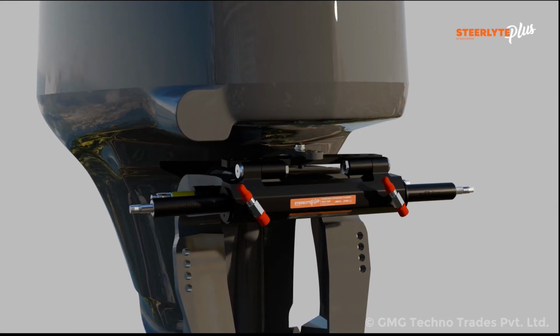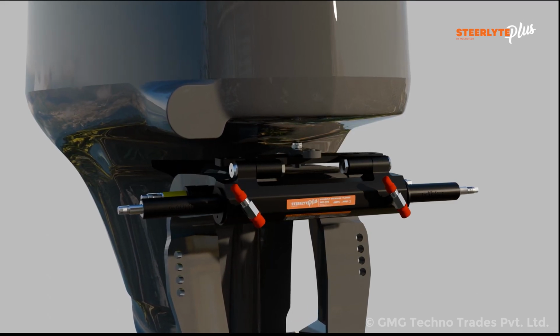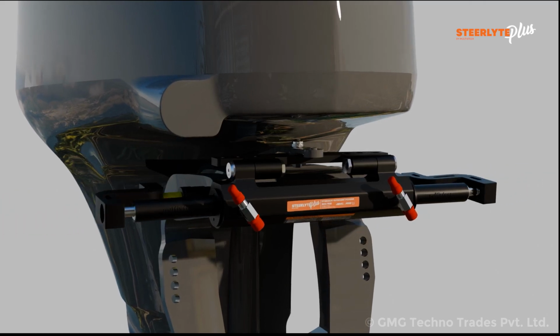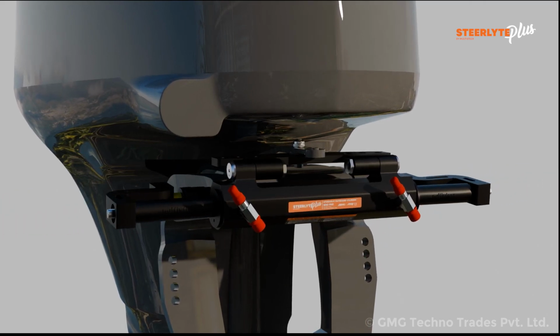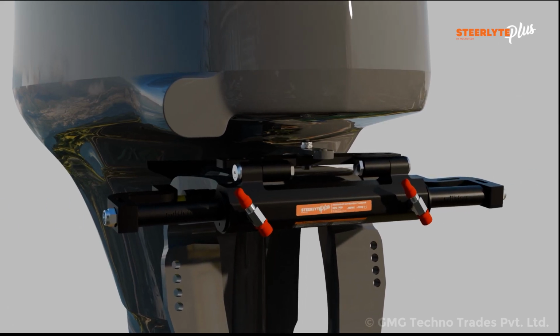In this phase ensure that the cylinder body is centered on the piston rod and that the engine is perpendicular to the transom. Insert the right and left support brackets by connecting both the piston and support rods. Insert the washers and nylock nut on the 2 ends of the support rod and piston rod respectively. Grease the nylock nut threads with any anti-seize grease.